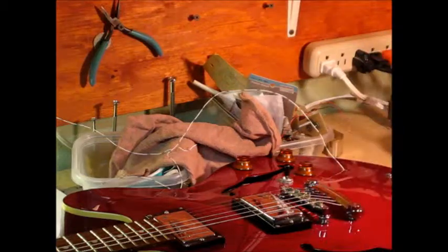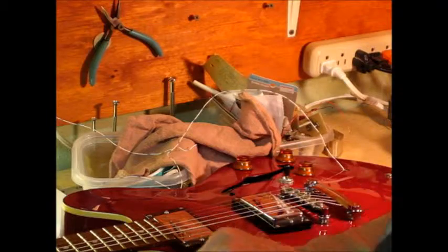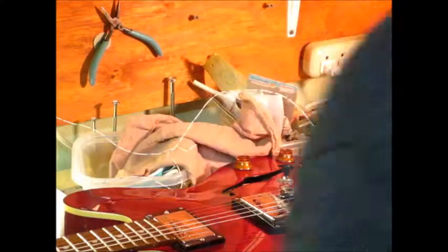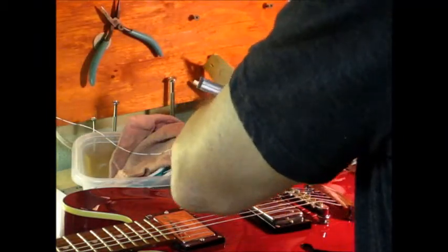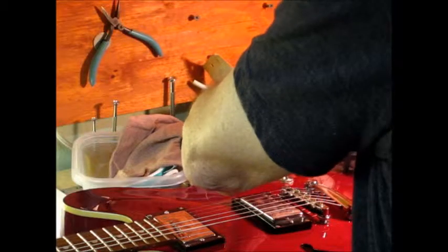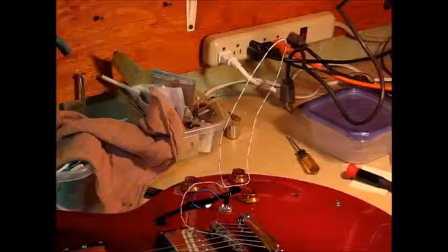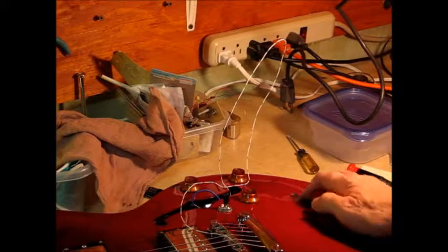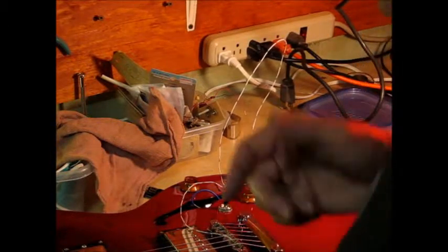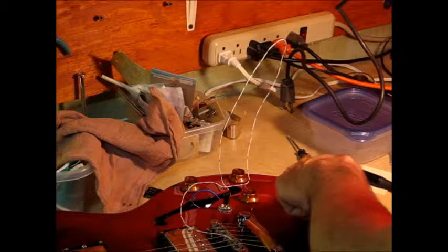You're going to have to gently ream this hole open a little bit. Here are the numbers. Just a 3/8, it's just under 370 thousandths. This hole, I'm going to guess, is like 9 millimeters maybe. Let's have a look. It's like 350. Now, at the risk of making the understatement of the year, I got to be really careful opening this hole up. I only have to open it up around, what did I say, about 15 or 20 thousandths of an inch. So I can do that with a file.